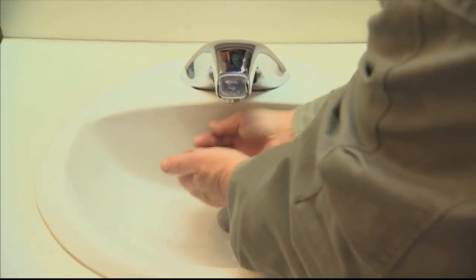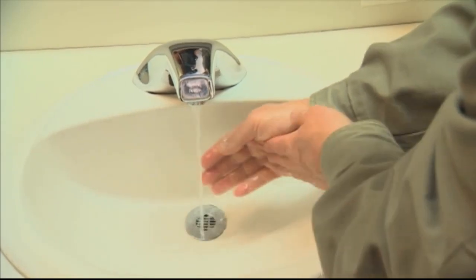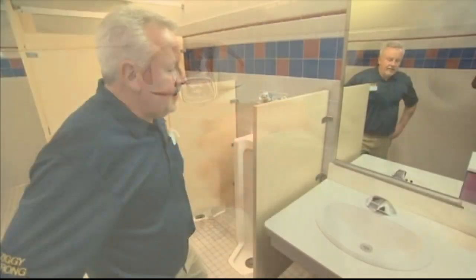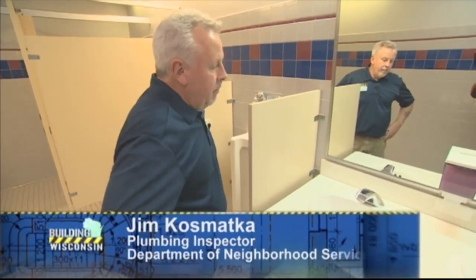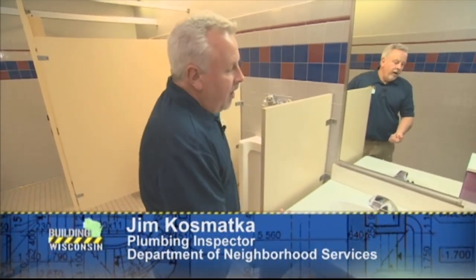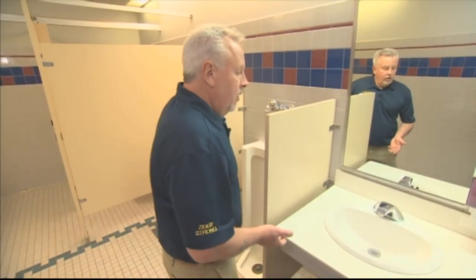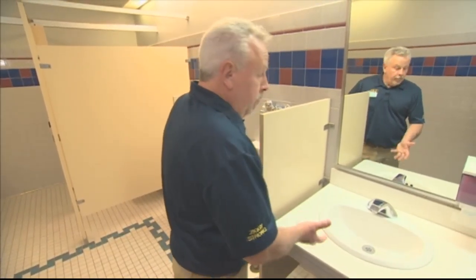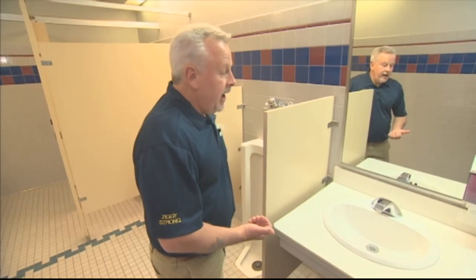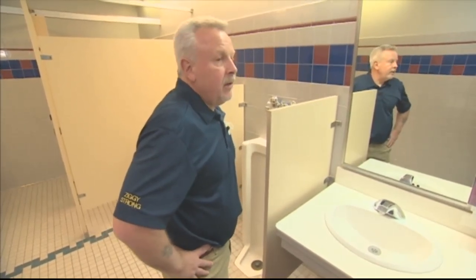Now over here we have a couple of touchless sinks. So you turn it on, and it goes, but there's very low flow. Is that a cause of concern? Yeah, people can see that not much is coming out of that restrictive aerator, and maybe taking off that aerator is not going to be enough to get that flow again. So you may have to pull this fixture out and flush that out of there. And again, that's a plumbing professional who's going to address that for you properly.